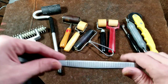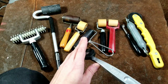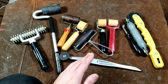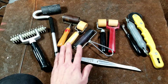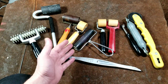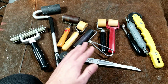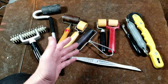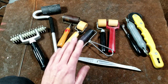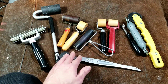So then we have seam rollers here, and we'll start off with this. Now, the reason you'd use a lot of these rollers is many times there's flat goods and items that you have to glue, and you really need the rollers. Things like wallpaper, linoleum flooring, Formica laminate countertops. The metal kick plates on commercial doors oftentimes are entirely glued, as well as have a few screws around the corners that prevent the corners from getting kicked up. And so that's a lot of applications.